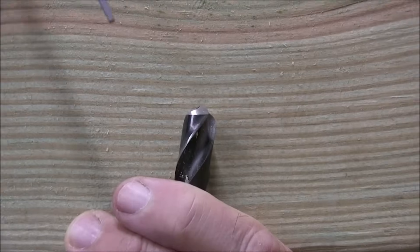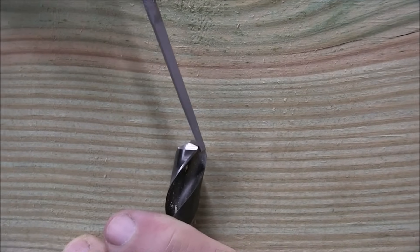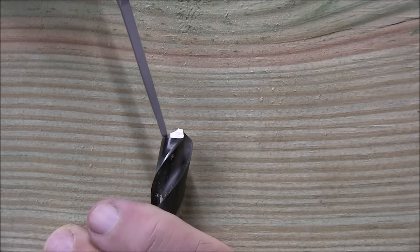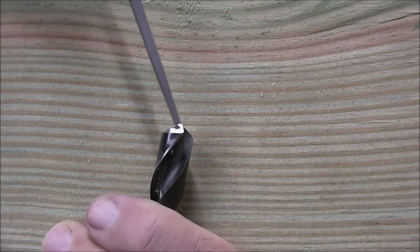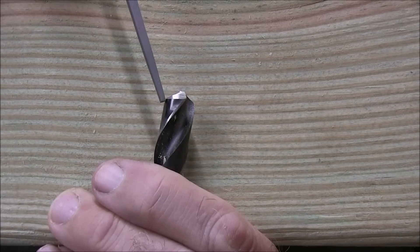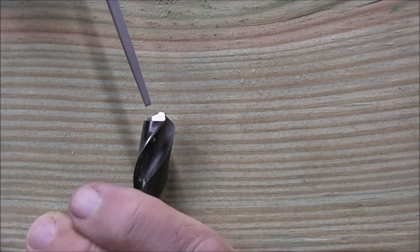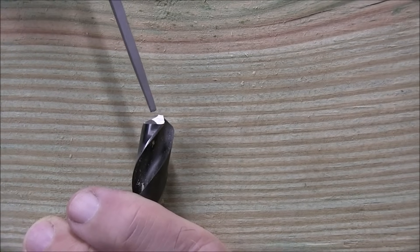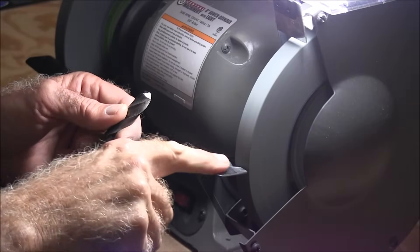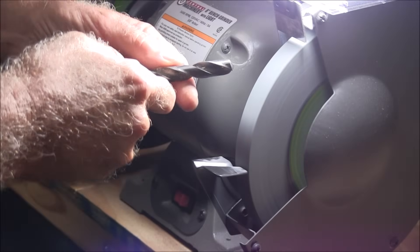On a drill you're going to have your cutting edge, which is right here, and this angle back here is your relief angle. You always want the relief lower than your cutting edge — obviously, because it won't cut if the relief were higher. In order to achieve that, you need to stay above the center line of the wheel like I showed you, and rest the drill on your finger so it's even higher. If this is the imaginary center line of the wheel, you want to stay up above it.